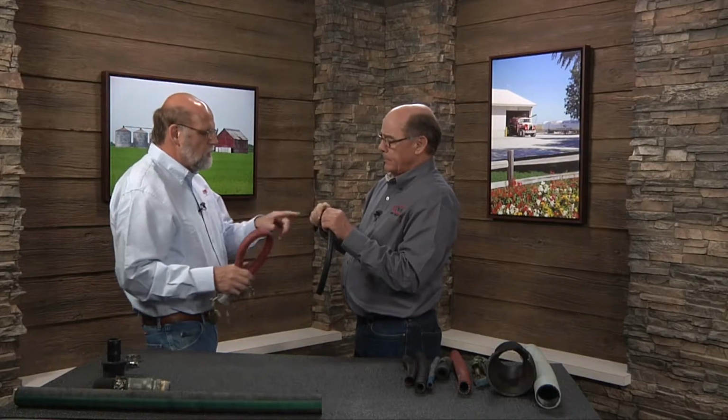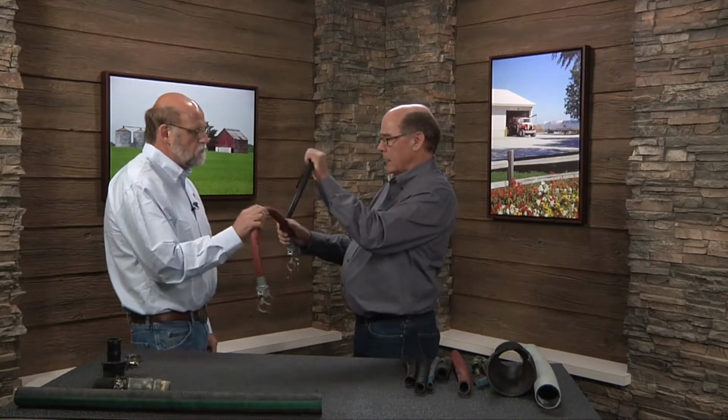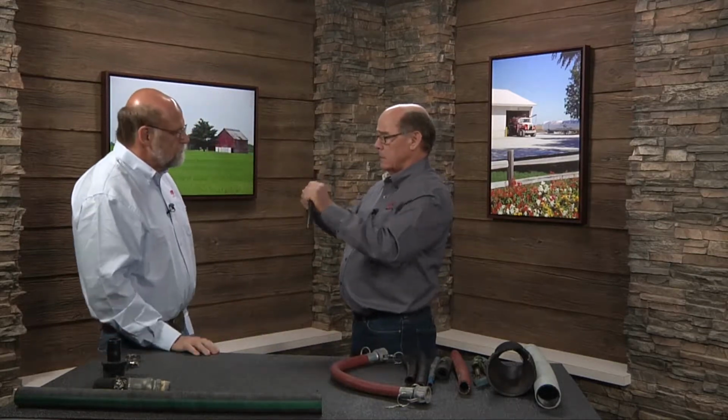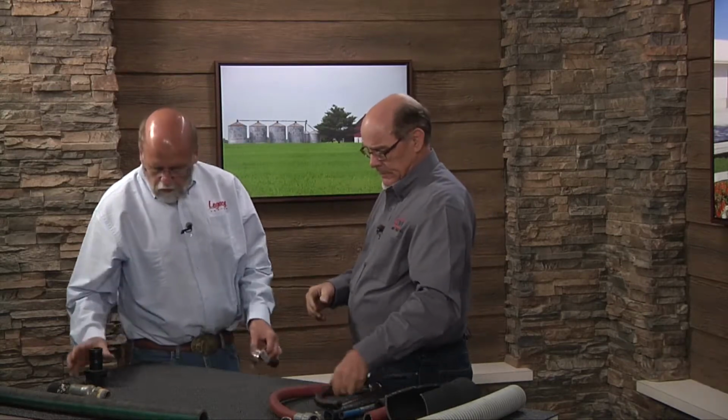Okay, and you made a point here, if it's wiring and I'm kinking it, which is different than this. Yeah, the nylon braided hoses such as this one, they're more forgiving. If you kink the hose like that with this one and then straighten it back out, typically it's going to be fine. The flow will return. You kink a steel reinforced hose like that and it's done. It won't straighten itself back out, because once the wire bends, it's bent.